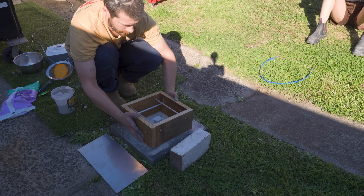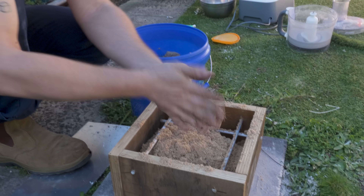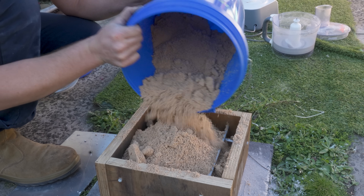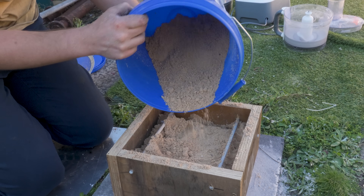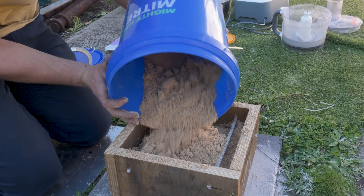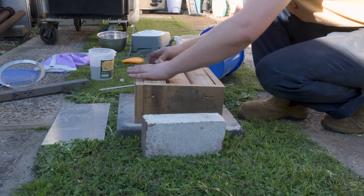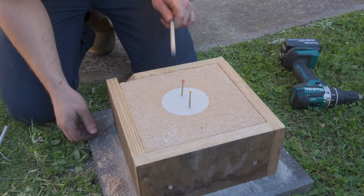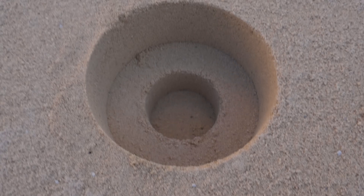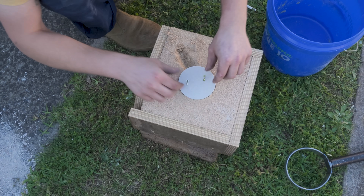Placing the printed pattern on a paver in the centre of my flask, I began packing the void with green sand. I don't think we can expect anything but lessons. It didn't take long to realise I'd been a little too generous with the size of the flask. Some scrap timber helped to pre-empt any blowouts while flipping the whole thing, and then I could remove the pattern with a little percussive persuasion. Cutting in a pouring channel would certainly have been easier with the pattern still in place, but with such a simple design, it was easy enough to press it back in to tidy things up.